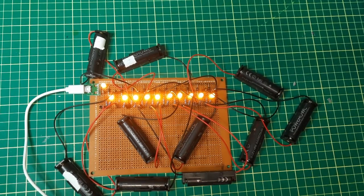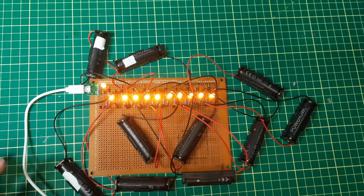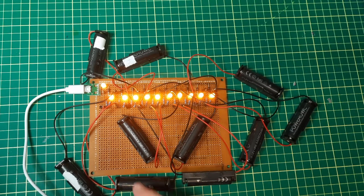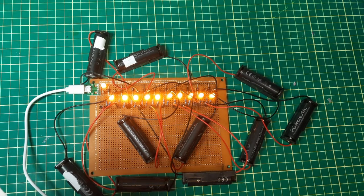I had pulled out four of these batteries and charged them. Number two is on the discharge circuit; three and four are as well. Number one, even though it indicated fully charged on my Duracell charger — designed for NiMH — stopped within five minutes. Number two had a whopping 0.218 amp-hours on it, and these are supposed to be 2800 milliamp-hours, so that wasn't even close. Number three was pretty good at 1.95 amp-hours; number four was 1.05 amp-hours.